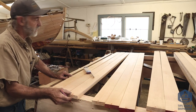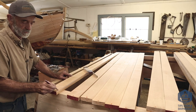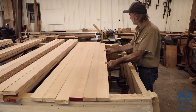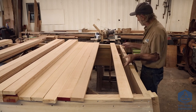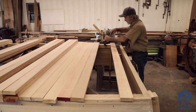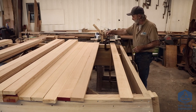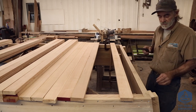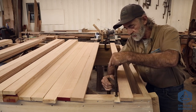I'm going to put them down from one end instead of from the transom. I'll push five of them out of the way and pull the first one back to its marks, then take some little blocks and clamp them down on the chines right here. The reason for that is so I can spread mud behind this one — if I squash it down and the mud covers the line, I won't be trying to figure out where to put the plank.